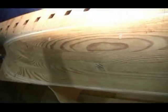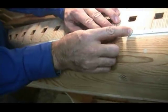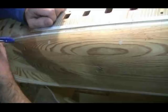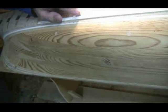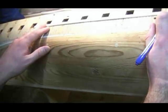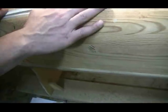Without any glue, only on nails, you can take it off at any moment and put it back. It is without glue, only wooden pins. Glue would be a problem afterwards, when it's planked, because you can damage the wood planks. So just drill holes with a toothpick-like wooden nail. It preserves the form perfectly; wooden nails hold wooden things wonderfully.